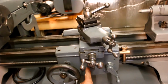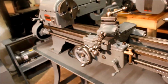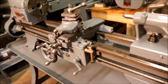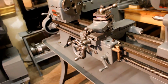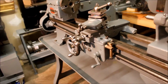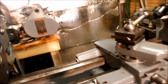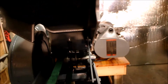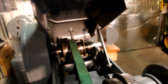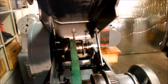New bushing. There's a gear in there. It required a new bushing for the bevel gear assembly that mates with the feed screw. I think there's about 3 bushings in there I had to replace. I had to replace that shaft. It was all mauled up, galled, and I don't know, jury rigged. It was in terrible shape.